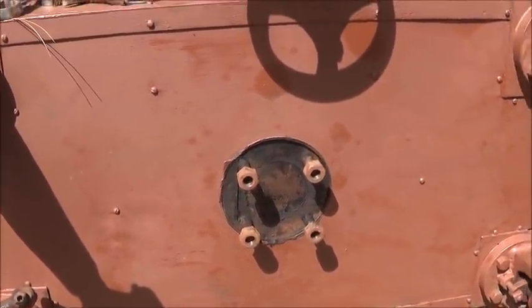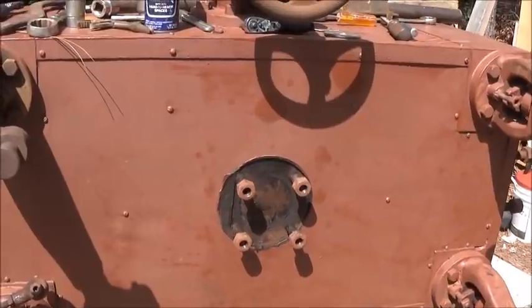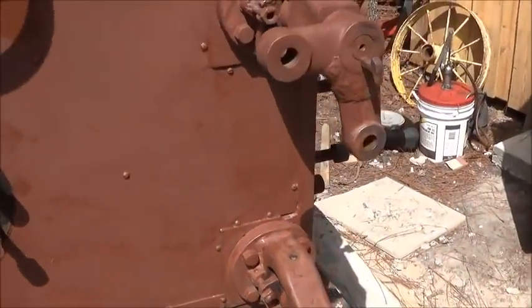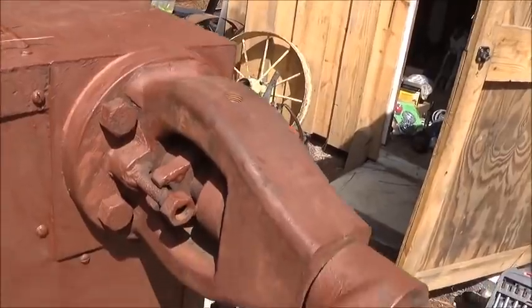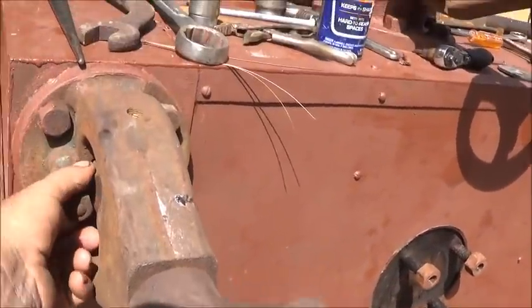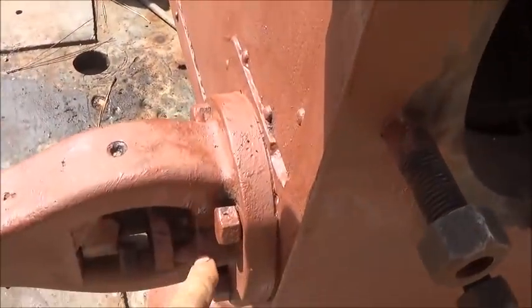You almost have to see it work to understand it, and I need to see it work so I can understand it better. Rich had the model and I was able to watch it. It'll be really nice to get this hooked up and turn this engine. The only fear I have is taking these valves out — there's been a lot done here. These packings have been backed off, welded on, there's a square nut on that one, and this one's been brazed on — so all these packings have been pulled out. I'm assuming it would have had a rope seal in there.